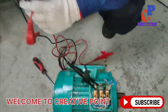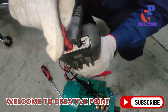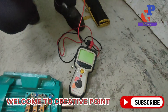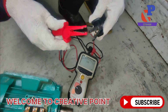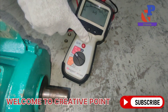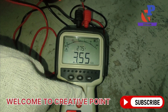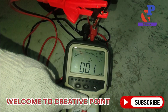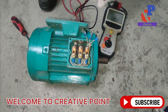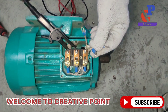Now we are going to test all three windings with the ground. We put the black cable into the negative terminal and the red cable into the positive terminal. To verify the instrument is in good condition, the technician shorts the terminals and presses the test button — the reading shows 0.0 megaohms, confirming the instrument is working correctly.